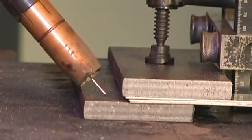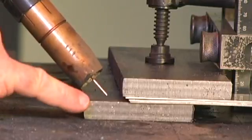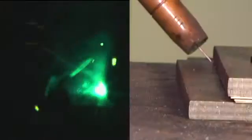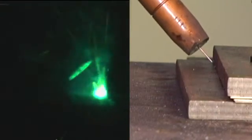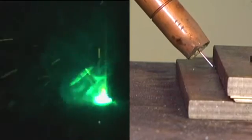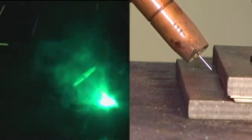You can clearly see here the final path point is a good half an inch off. What you're seeing is the arc oscillating from left to right. It's tracking from the two faces using the impedance to keep it centrally tracked in the root of the joint.